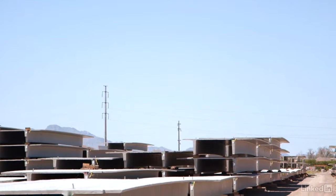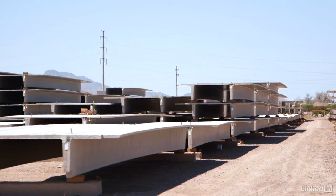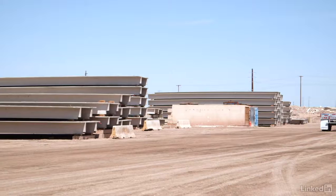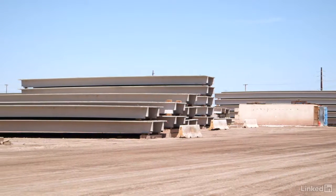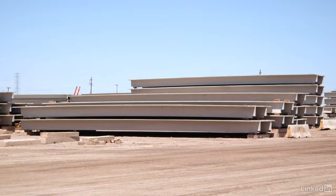If I place that same steel down in the lower portion of something like a beam, I'm actually going to squeeze the bottom more than the top, and I can induce bending into the concrete. Sometimes I do this on purpose. For example, if I'm making precast concrete pieces at a plant for a parking structure, we design them to have this bending or camber so that when I erect them in the field and gravity pulls down on the middle a little bit, they deflect and flatten out. In this case, that's what I want it to do. But back in my tennis court examples, getting those cables installed in the middle is really important because I don't want to have any bending.